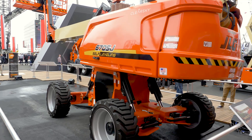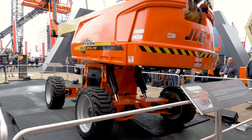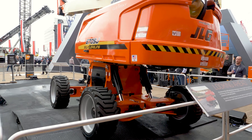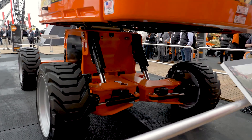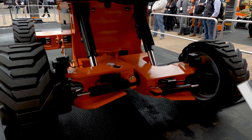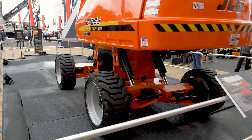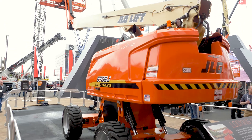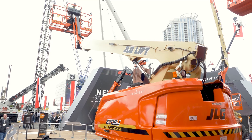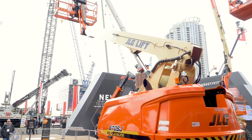Milan, are you ready to show them what self-leveling looks like? So as I raise the boom, the boom lift will stop once I reach the limits of transport position and the chassis leveling will begin. Now that the chassis is level, boom functions will resume and I can go up to height. What you can see is the platform is now level and Milan as the operator is able to focus on operating the machine. In addition to that, we now have a completely level counterweight and boom section.